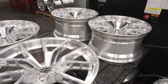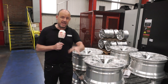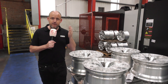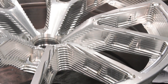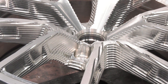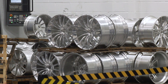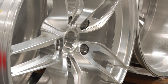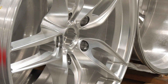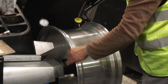Here's an alloy wheel that has just gone through its roughing operation. The total machining time is about six hours, but by switching from a vertical machining centre strategy to horizontal, they've minimised the number of operations and now do these in just two ops. To verify the wheels are perfect, they do a final rim turn — a very light cut — and then balance the wheels 100% to make sure they're perfect before going to the customer.